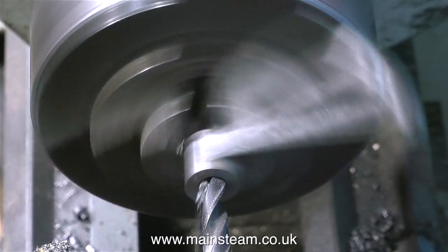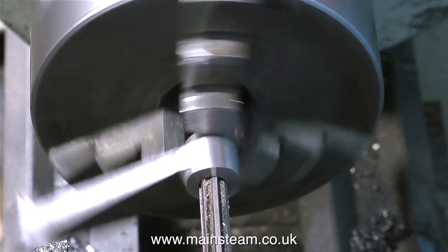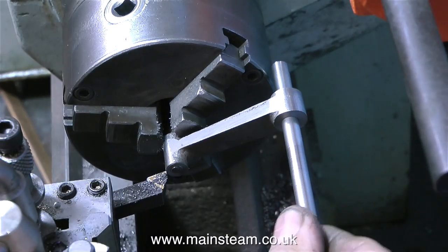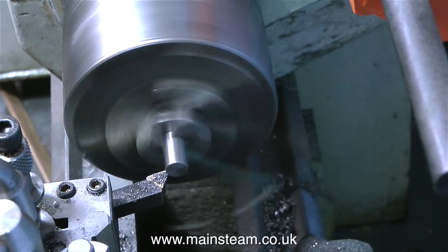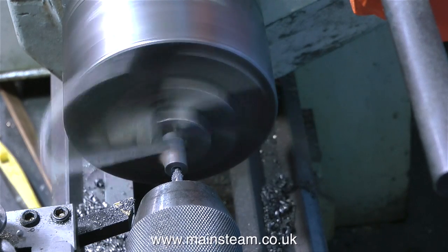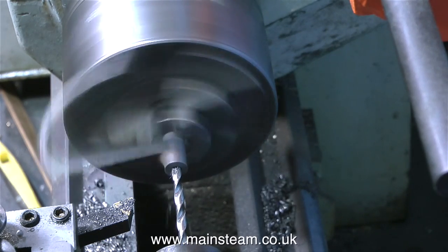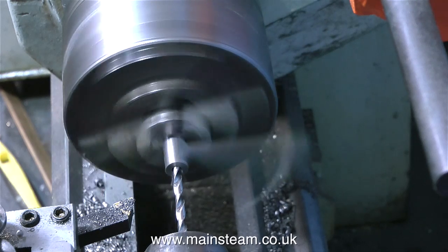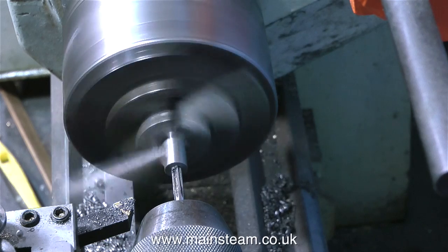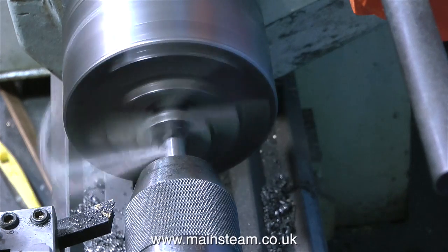Time to make the drop arm from the cast iron casting. I hold it in the chuck, centre drill it, drill it and ream it, then I reverse it in the chuck and put a bar through just to check that it's in line. Then I remove the bar, machine the other end, drill it with a centre drill, then drill all the way through and ream that too. And that's the drop arm finished — a very simple job that could go spectacularly wrong, but you're only going to lose a drop arm. A replacement drop arm from Stuart's is not very much money, but a replacement flywheel really is.